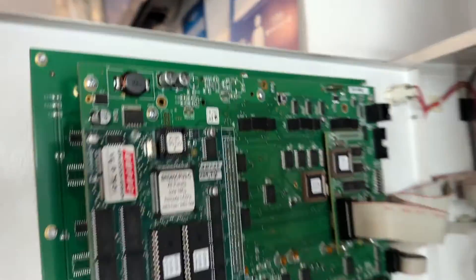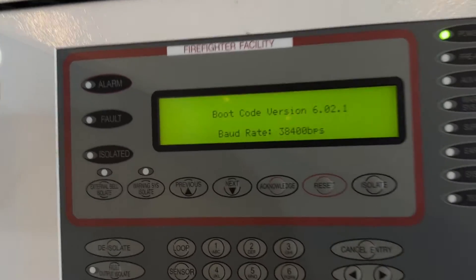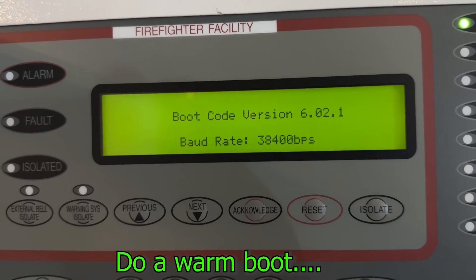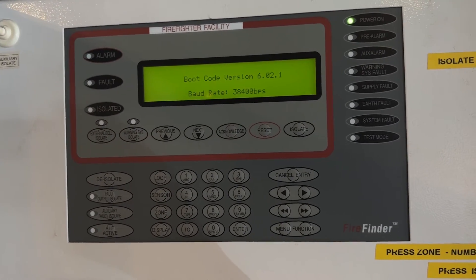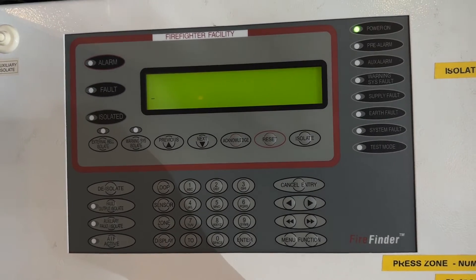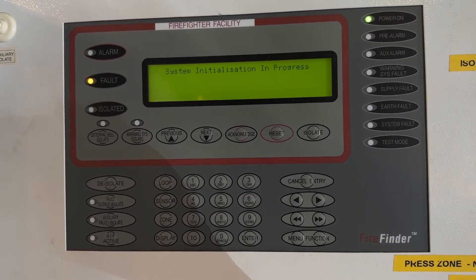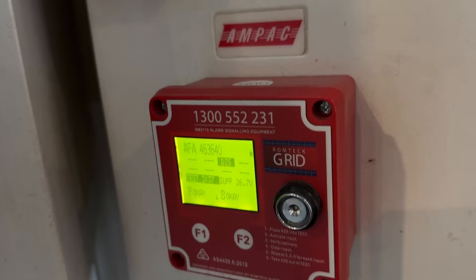Press that — big noise — it starts to trigger a rebooting. The system will come back up and that particular detector's maintenance fault will be reset automatically during initialization. But don't forget — always make sure that your system is in test mode or isolated while you do this. We're just waiting for it to reboot.